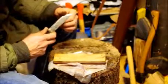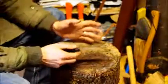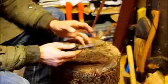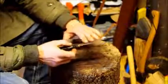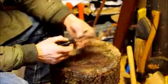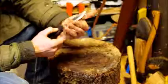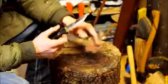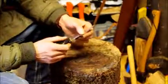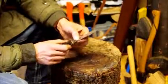So once we're happy with this grinding part of the process, the next step is to strop on leather. Now, the reason we strop is we've created an edge with some sort of swarf ground material that's curved one way and then curved the other on the block, on the stone, and become smaller, but there's still some material there, and we want to get rid of that without it taking along with it any of the cutting edge